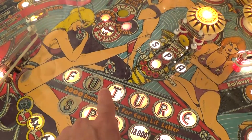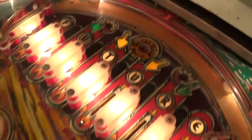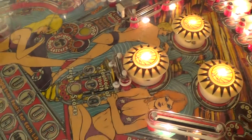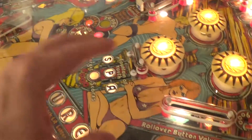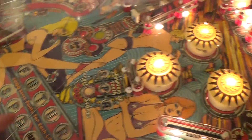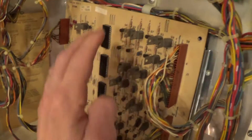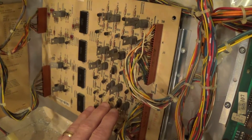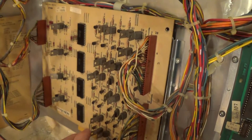So I did start a lamp test and you can see there's several lights out — the U, the S, the 2000, I think there's a 2X, and a U up here. Now previously there were other lights out, and sometimes when I plug this thing back in, some lights work and some don't, and then it kind of reverses itself later. So I started thinking maybe it's not the SCRs, which I've already tested and can't find any more that are out. I also checked all the continuity of the traces on the back end of this thing and everything seems fine.